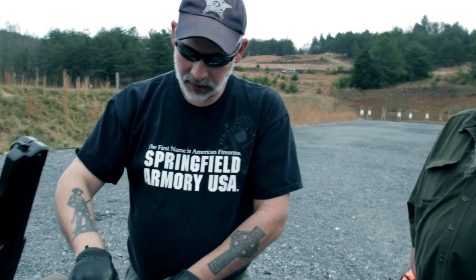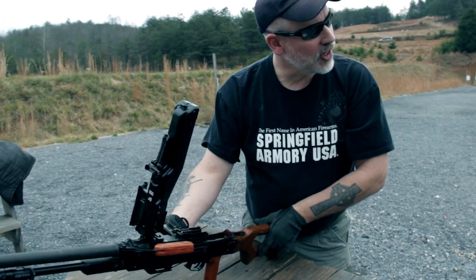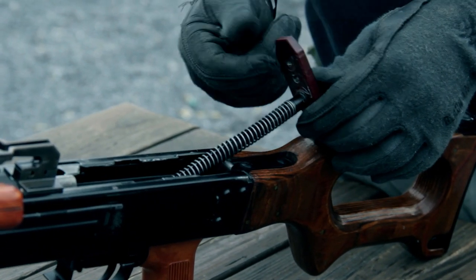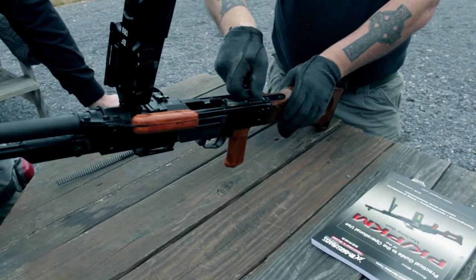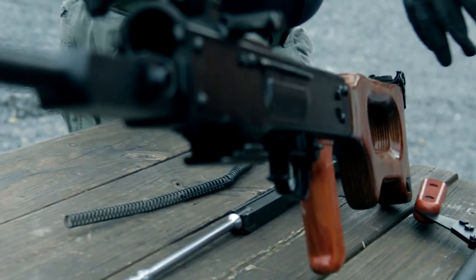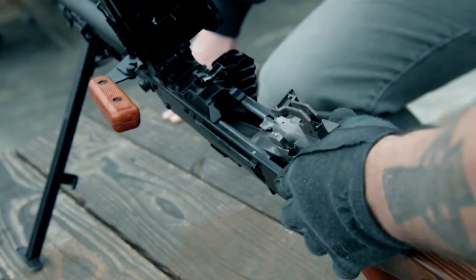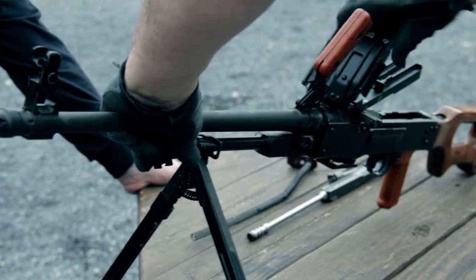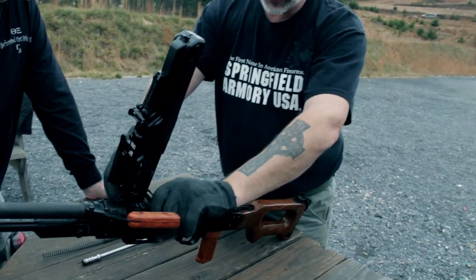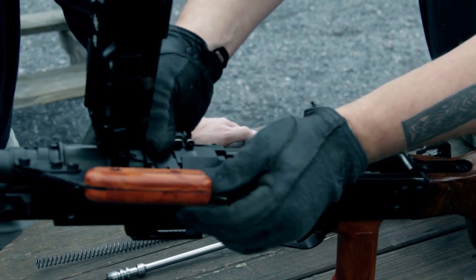Goes apart totally different. Top cover — lift up. It's on safe, so it won't pull back. Weapon needs to be on fire for your bolt to come back. Pull back. Charging handle goes forward. Operating spring and buffer — that keeps from tearing up the receiver. All the way to the back, just like an AK, lifts up, pulls out. Now the firing pin is removable, but when it's being fired it's actually locked into position and in a fixed state — the firing pin's not moving when you're firing. So when you're inspecting the gun, you check the end of that firing pin, make sure it's not eroding, busted, cracked, or chipped.